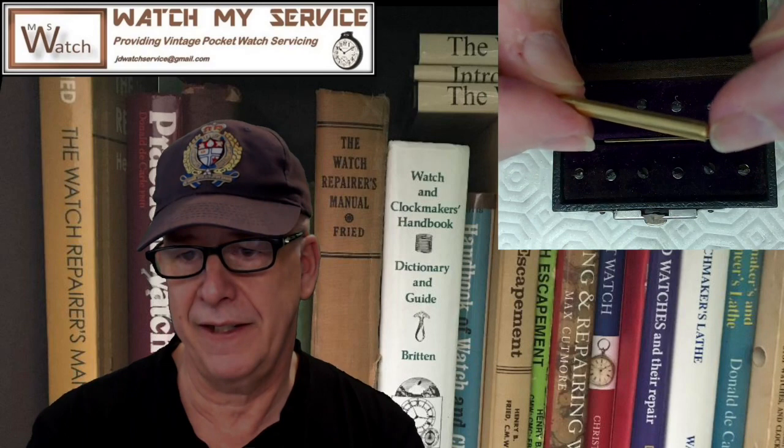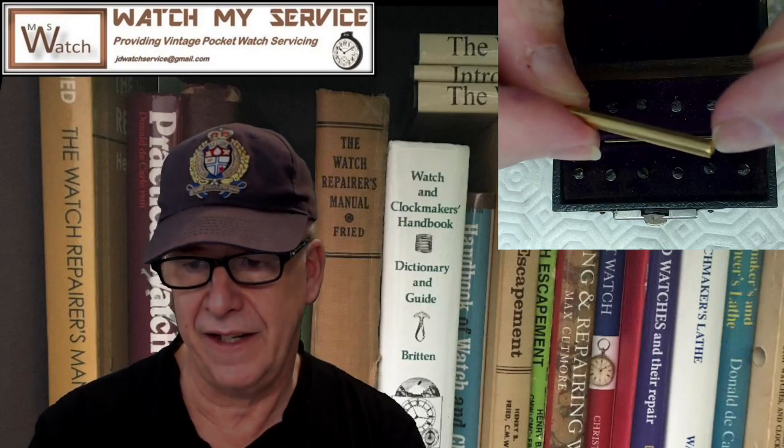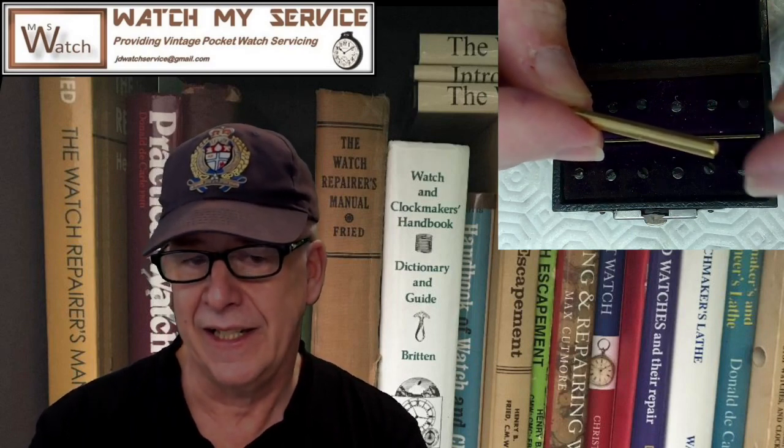And then after I drilled a hole the perfect size and kind of rounded it on the inside, I had to cut that little canal. And that little canal has the metal that burnishes over the jewel itself once you put the jewel in place. So go look for my video on how to make a jewel setting. I made some pretty beautiful little jewel settings that worked like a charm. And I found this on the internet.